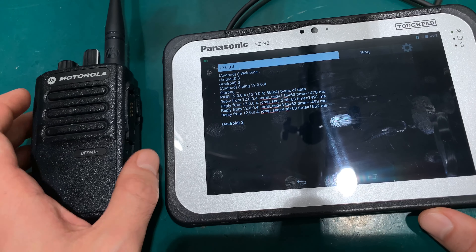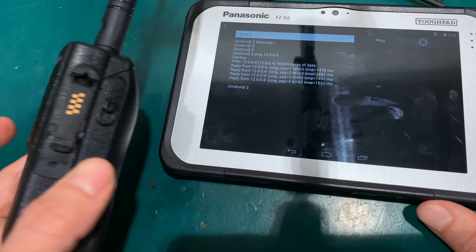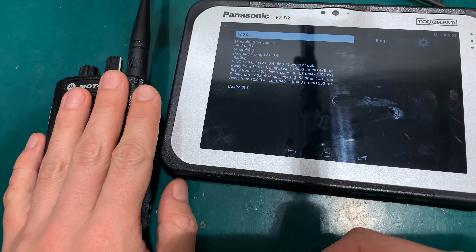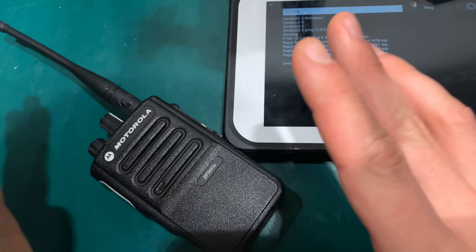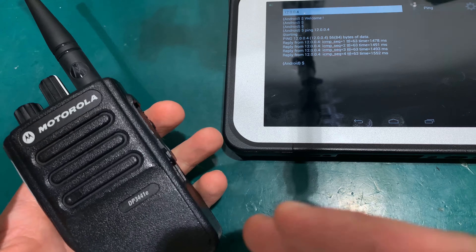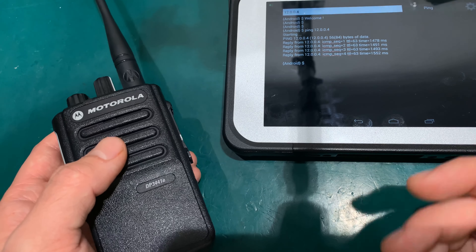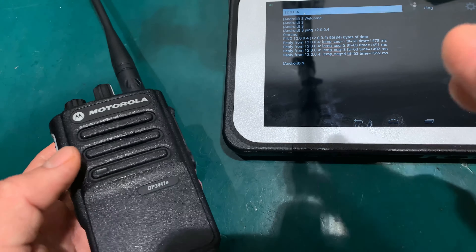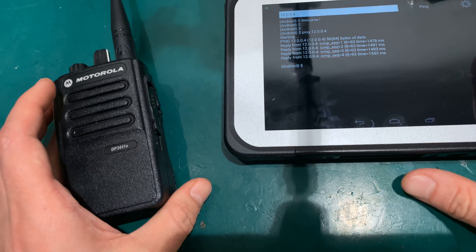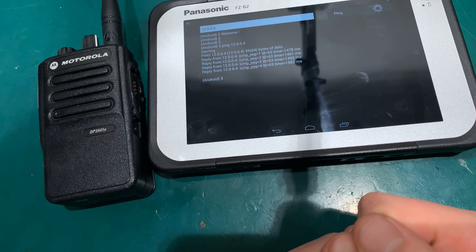You might ask yourself why this is a good option. This is very useful because if you are deploying in the field, you can put this radio on a tree, tie a rope, elevate it, and in line-of-sight that gives a big improvement. You could say that's not the correct way since a handheld radio — you are part of the antenna, one of its elements. But in the case of UHF, which we are using here, it's not as dependent on that as lower frequencies, so for UHF you can get away with this. I hope you find that interesting — thank you very much for watching, see you next time.